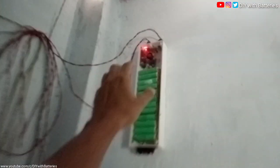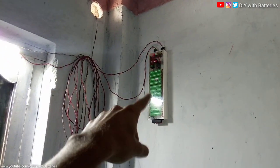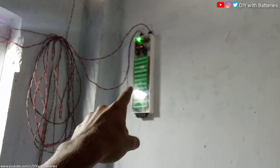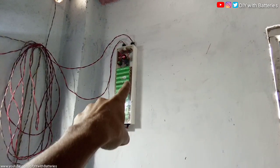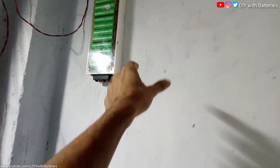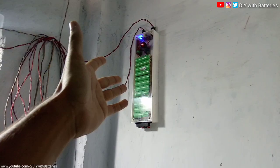Let me close the door and turn on the switch — here we go. It doesn't look much brighter because I didn't charge the battery after testing the capacity of the cells. If it doesn't provide enough backup, I'm going to connect a few more cells — like another 3S 10P pack. I'll buy a few more boxes and connect them beside these ones, connecting the cells in parallel using these 4-pin connectors on the balance leads of the additional packs. Yeah, there's the power wall.